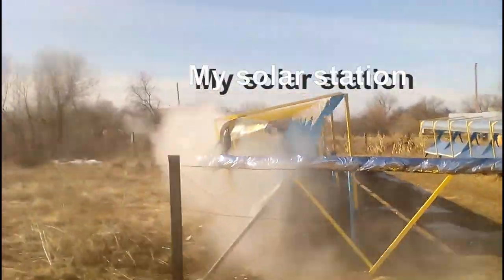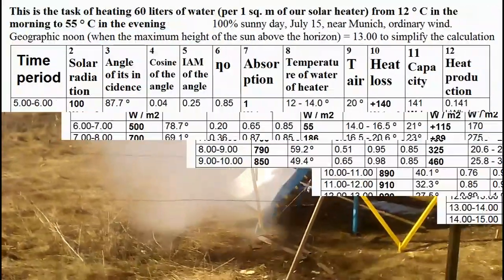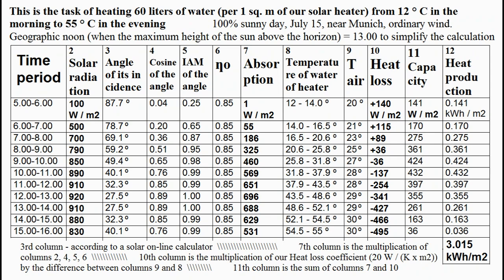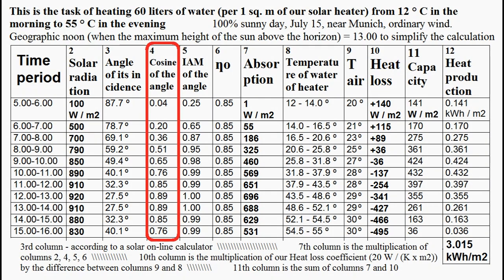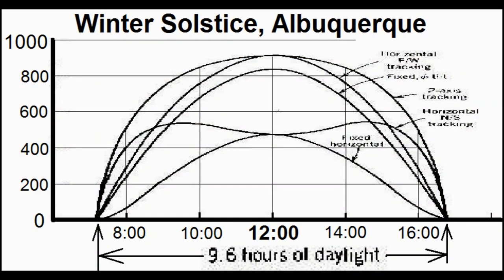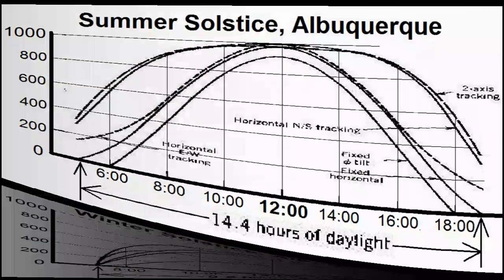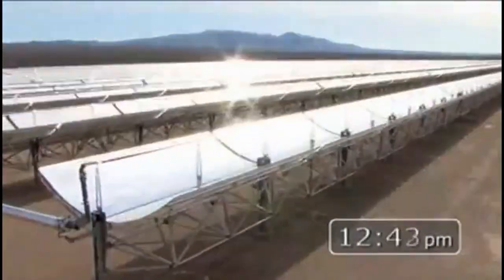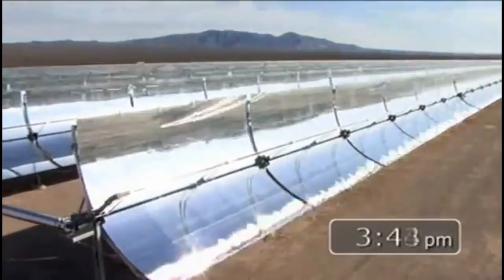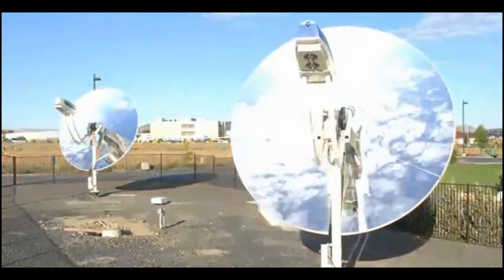My experiments and research use more sophisticated calculation methods on the basis of similar tables, but my methods have a very complicated explanation. For example, I often do complex calculations of this angle of incidence, and I often refuse this universal graph, replacing them with more adequate methods for cases of some types of solar collectors. In addition, I take into account the cosine of the angle of incidence, but this fact requires the use of similar daily solar radiation graphs for a surface which is constantly perpendicular to the sun rays from dawn to dusk. Interestingly, these graphs should also be used for the case of solar heaters which follow the sun from morning to evening, and more accurate calculations take into account only part of the solar radiation which is called direct radiation.